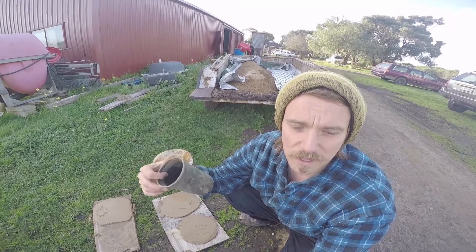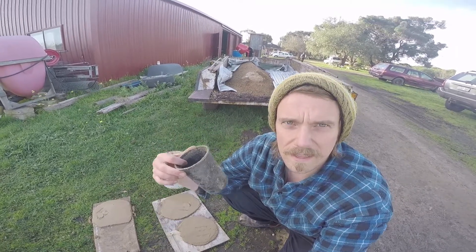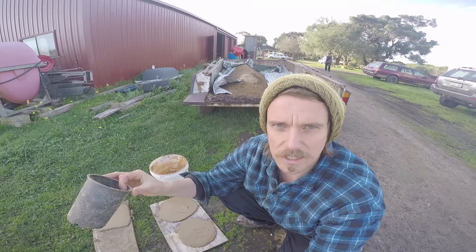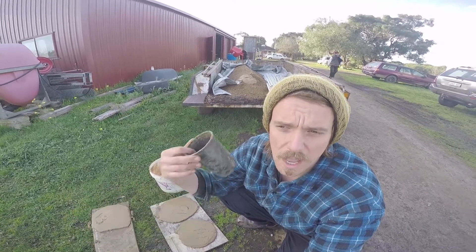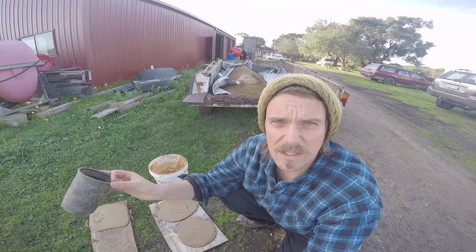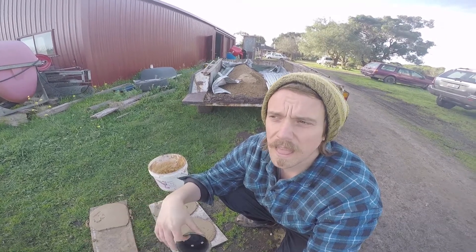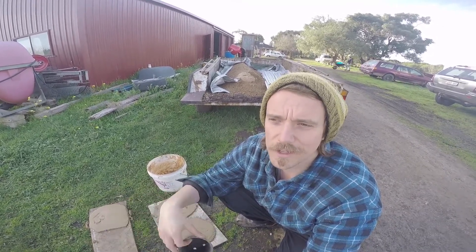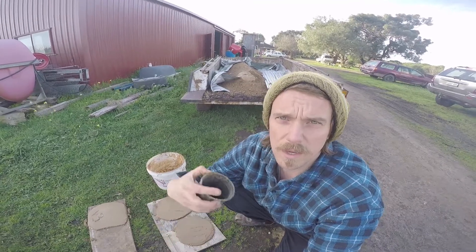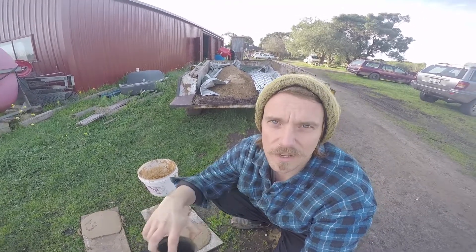I recently bought a brand new cement mixer, which I'm really pumped to use, so we're going to give it a shot tomorrow. We understand there's going to be some settling because we didn't take away the grass from underneath — something I didn't think to do before putting the waterproofer on top. But we've already packed it out with a dry pack that's been settling for over a week, close to two weeks, so hopefully that's taken out a bit of the settling. We know it's going to probably crack a bit, so we're not putting any stabiliser in it so we can come back once it cracks, wet the cracks and fill with a clay slip to fix them up.